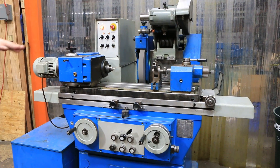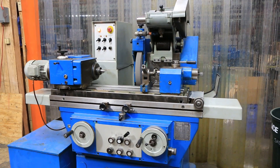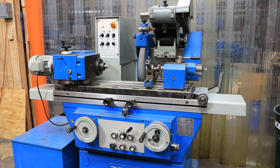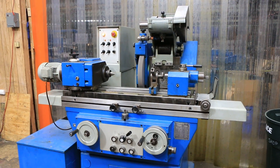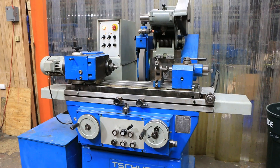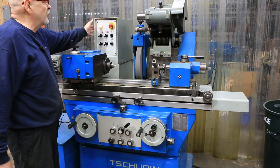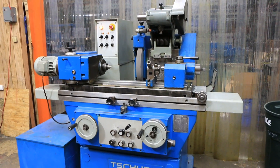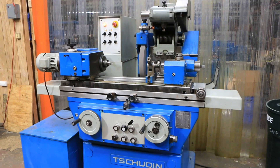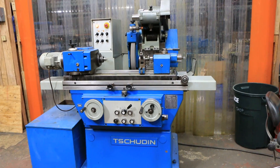This is a 14-inch wheel with a five-inch bore, and your hydraulics are mounted inside the grinder for thermal stability. The machine warms up after a while to a set temperature. The electrical cabinet is mounted up here where you can work on it. That's the Studer model HTG 400, and all the other specifications can be gotten off of our website.